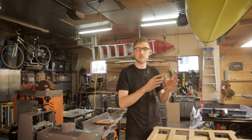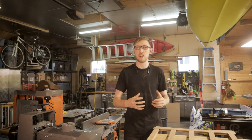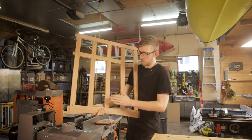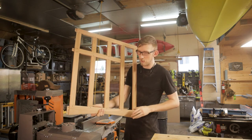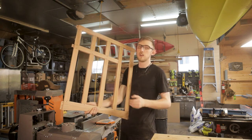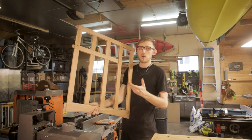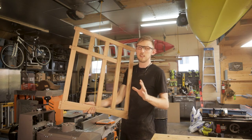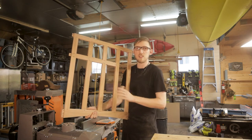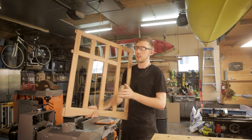Not a big deal, but when I do the other three sides — doing it all through the drum sander — they'll come out nice and perfectly flat on all the pieces and go together a lot nicer, even though this side looks absolutely beautiful. Right now I haven't done the finished sanding on any of these pieces; they're only sanded up to 120 grit on the drum sander, because that's all I have. The store here in Calgary where I bought this doesn't really stock the pre-cut belt, so I've ordered some from Quebec and they should be here in about a week. So I'm just going to go ahead and hand sand this with 180 grit anyway, which will clean up all the drum sander marks.